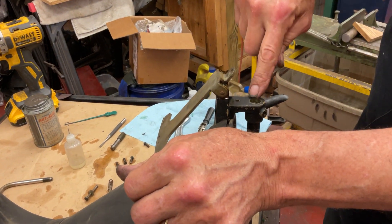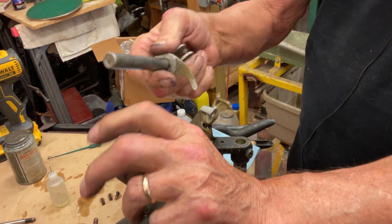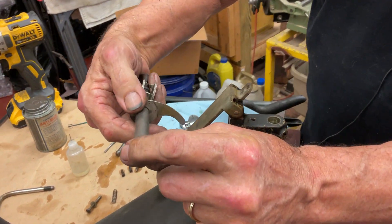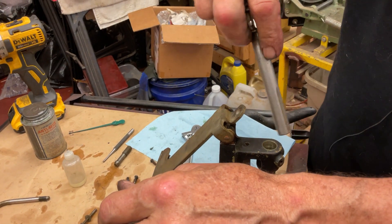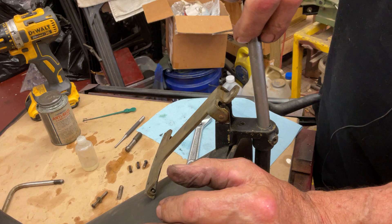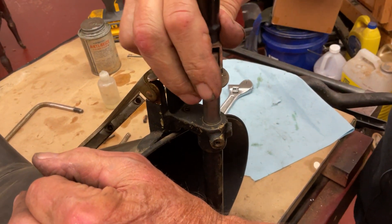Next you want to flex hone this hole. This is where the lift handle fits in. What I do is on the belt sander, I just grind off a little bevel on the edge — that helps it go in. You need to clean all this flex hone in here because we have a slot which goes into this screw, and you want this to be able to just slide in smoothly.